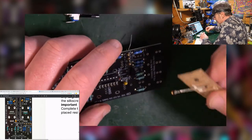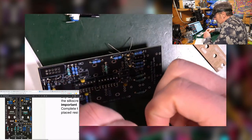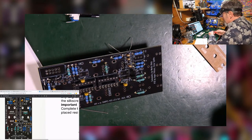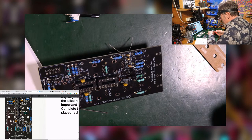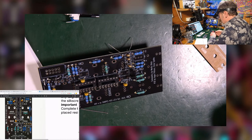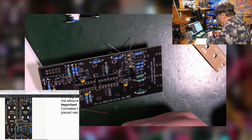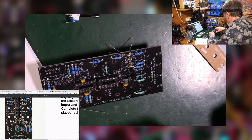You can measure them with a multimeter. Okay. What resistance? Because they are thermistors. They're 11K and rising. 11.3K. Has the measurement of this done me any good at all? If I put my finger on it, does it drop? Yeah, it does. Look at that. So, yeah, I can sort of measure it.